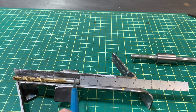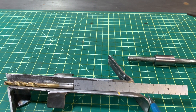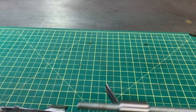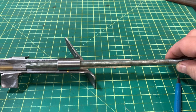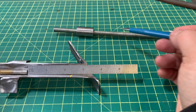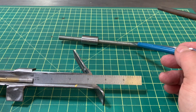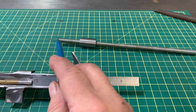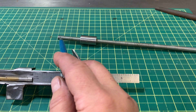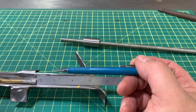So that's a quarter inch drill, which is four inches long. From here to the end is about four inches — I'll probably give myself an extra inch just in case. I'll take this all-thread and cut it at five inches. Then I'm going to need some sort of knurled knob and something that will attach to the end of this bolt in order to push against whatever drill is going to be there.